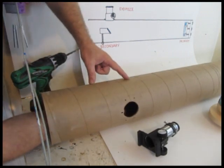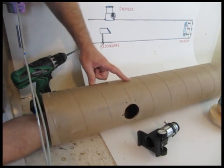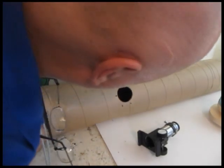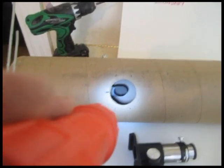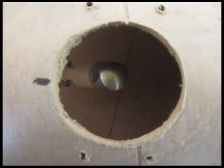If you want to make a telescope, just go for it — you'll figure it out. There are lots of resources on my website, TelescopeNerd.com. The secondary mirror bounces the light off the main mirror, out the tube, and into the eyepiece. You want that to be centered right in the hole and in the tube. In mine, the first time I did it with just that one half — I ended up threading a rod all the way through. Do that for strength and stability, all the way through, not just halfway. That's much better, and you can thread those nuts back and forth to adjust the location.